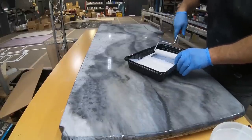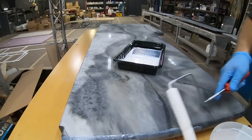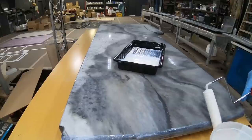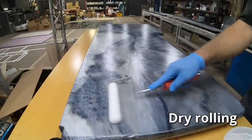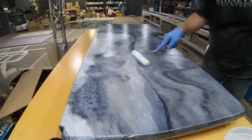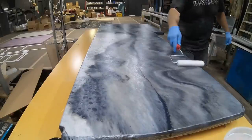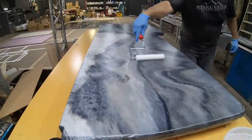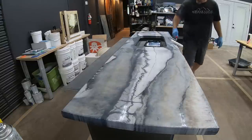It's a two-roller technique. After I mix the material at a two-to-one ratio, I begin my wet rolling. I've taken my quarter-inch nap roller and fully saturated it in the ultimate top coat. As soon as I'm done rolling it on wet, I immediately dry roll the surface to remove any excess material. This is the key to getting zero lap lines and a very tight finish.